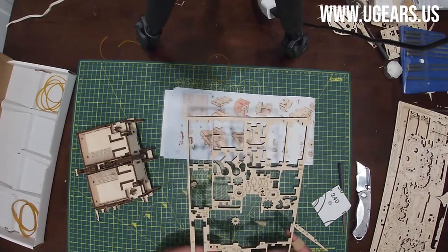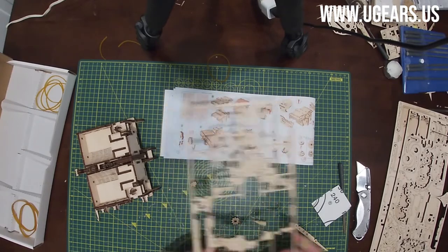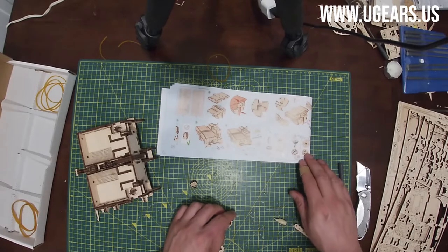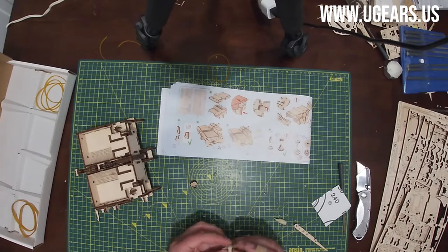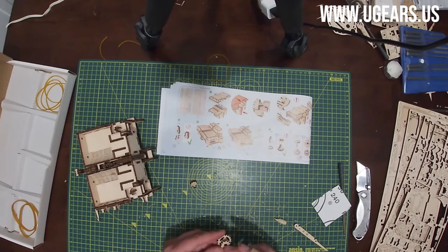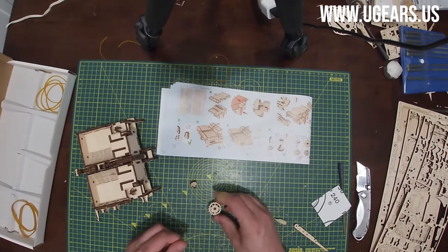There are two of them. And 51 is to the right of the center line. That would be our R2. Now here we need to wax all the gears, obviously. And then 51 faces down, the two dots closer to you. 50 we insert into the 51 with the longer portion sticking up, and then 49 goes from the top with the dot matching the dot here, and then the little marks are going to be facing towards left. There, we insert it closer to 51, and that's going to be our R2.